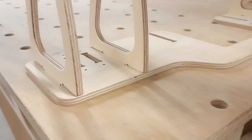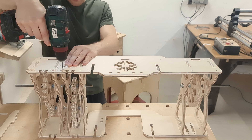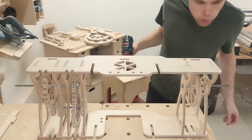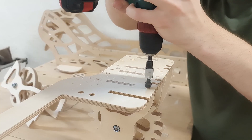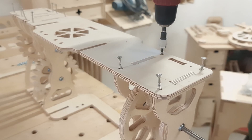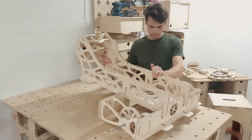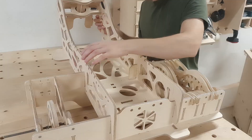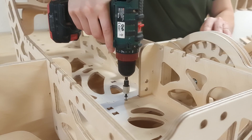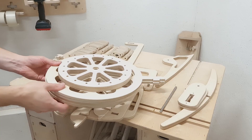When the brake assembly is completed, we can attach it to the frame components and add the other go-kart frame part, then secure the assembly by adding a couple of screws. Since the components are made out of 9mm thick plywood, we have to pre-drill each component to prevent the screws from breaking the parts. After the pre-drilling, we could countersink each hole to ensure the screws are flush with the surface. Once the back assembly is complete, we can attach it to the main frame. The assemblies are joined with simple half-lap joints. And with a couple of screws added to the floor panel, we are ready to work on the wheels.